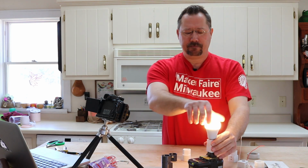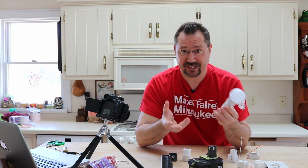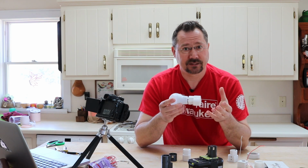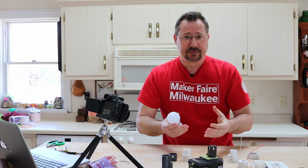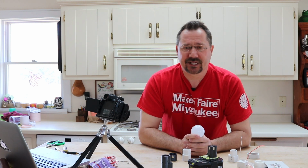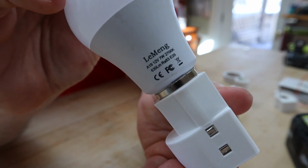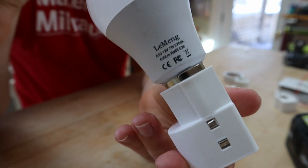Now at this point though, I bet you're saying, well, wait a minute, how can you do that with a light bulb? A light bulb is 120 volts AC, right? Well, typical light bulbs are, but there's a lot of other types of light bulbs out there as well. The big thing is landscape lighting light bulbs. There's a lot of lighting done outside of people's houses, and typically that's low voltage, often 12 volts, and typically that's actually AC. So if we look on the light bulb here, we will see that this one is listed as 12 volts nominal. But the thing is, it'll actually run on AC or DC.